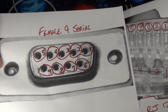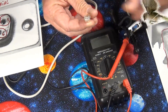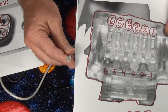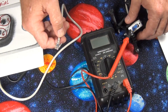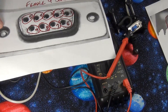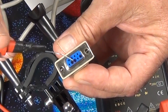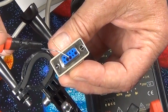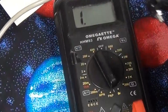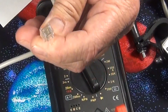Figure out which of these pins go where. Looking at this male RJ12, you would think that six pins would equate to at least six pins on the female side, but when I started pinning this out I found something a little different. I marked with little red dots on top to indicate the live pins I found. I only found three live pins out of the nine coming from the six, which I guess is possible, but you would think they would all be accounted for.